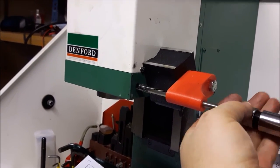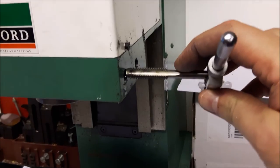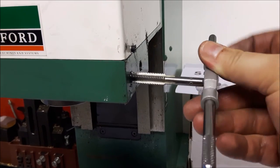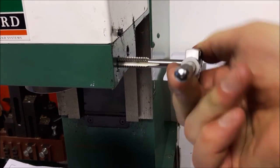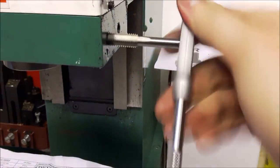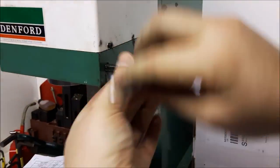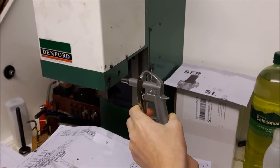Fortunately I have an M10 bottom tap. Swapping over to a more traditional setup — since it's already nicely tapped I don't need to worry about being square. Just doing the normal routine: twist it in, back it out, twist it in, back it out, and cut the threads all the way to the bottom. There we go.